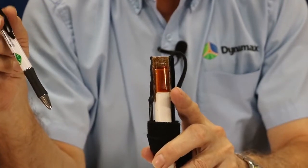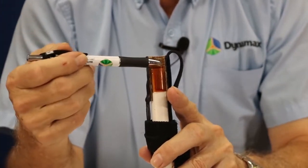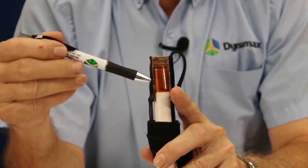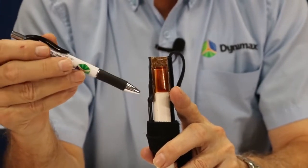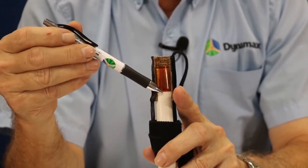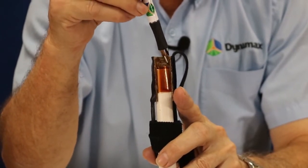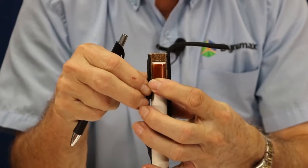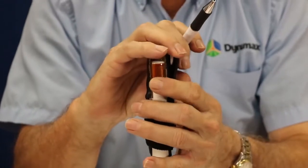So on the new SGDC and ExoSkin sensors, the heater comes with a very special design. It's got a new quad layer of integration of Mylar and the heater itself. So it should be able to last about 3 to 4 years with proper maintenance and with good installation practices. So this does add durability. We also have thermosensors on the SGDC and on the ExoSkin that come in direct contact with the irregular stems. So this could be a very irregular stem and I would still get good contact with the sap flow heat as it's applied to the sap flow itself.